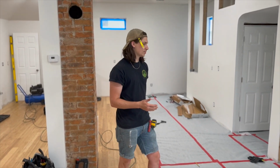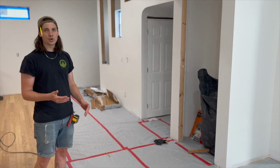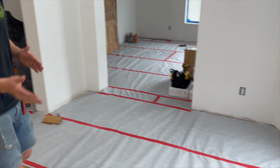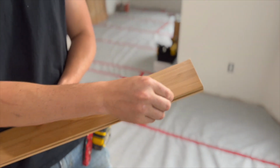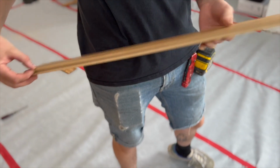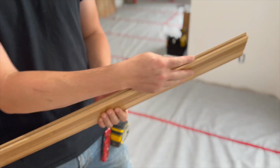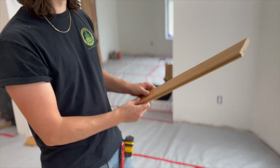If it was off by a couple inches, maybe some things that you could do to hide that would be transition strips at the door. If you have the tools, you really could do a whole row where you shaved off maybe at an angle, 1/4 or 1/8 inch, and then recut the groove. And that would kind of help you correct or straighten out the difference that you're experiencing.